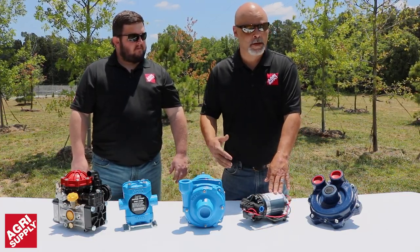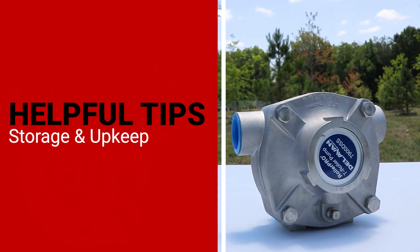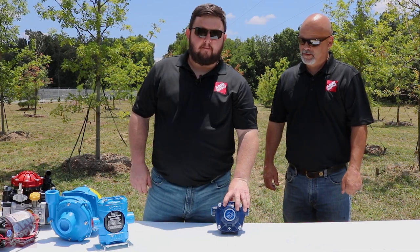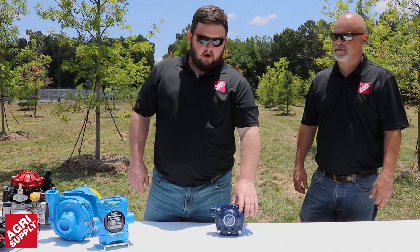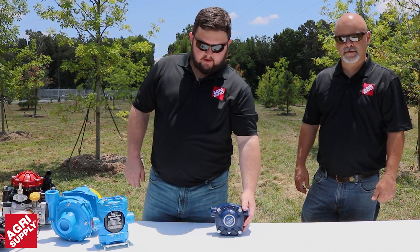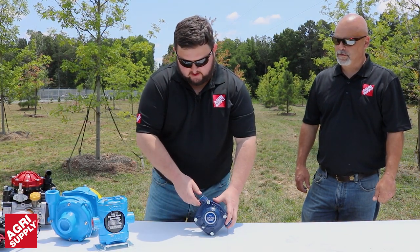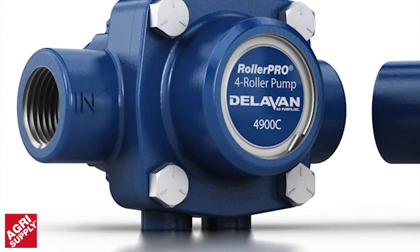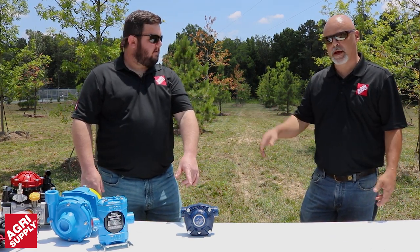If you have any questions, please feel free to stop by any of our Agri-Supply locations. Lastly, we'd like to leave you with a few tips on how to properly take care of your pump. In between spray cycles, it's a good idea to run some fresh water through your system and a neutralizing agent. At the end of the year, when you're done using your pump, flush it with clean water and add RV antifreeze, then cap the pump off for storage. It'll go a long way to help your pump last longer, and the RV antifreeze also has rust inhibitors in it, which help protect the bearings and seals in the pump.